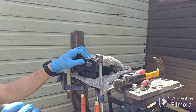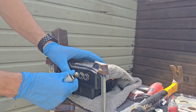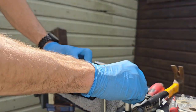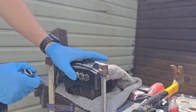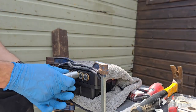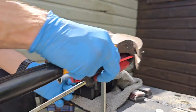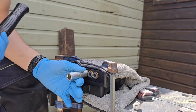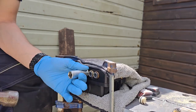Make sure the edges of the manifold are not rough. If they are, file them back a bit. Mine are okay. Grab your new cartridge, push it in. I've got three-eighths cartridges here so I need a 16mm socket because I want to push on the metal around the cartridge and not on the plastic part. So socket on, hammer — you've got to really whack this. It feels like you're breaking it but you're not. Make sure you've got your manifold clamped down tight.